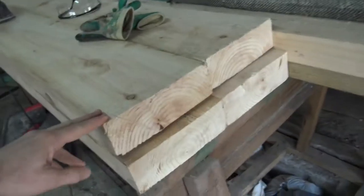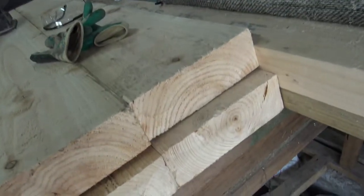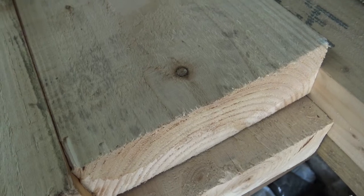This afternoon is going to be a whole day of sanding. I'm not going to bother filming all of it because it's pretty boring to watch. Next time I will be buying planed timber even if it costs double the raw cut, because it simply saves you days of work — hours and hours of sanding and grinding trying to make it nice to the touch. If you buy it planed, all you have to do is cut the wood and maybe sand the ends. Everything you touch on furniture has to be smooth — there shouldn't be anything that stabs or grabs you.